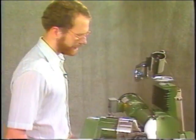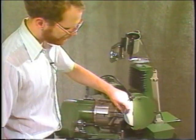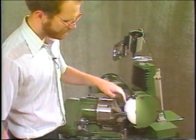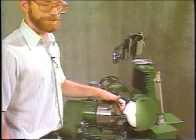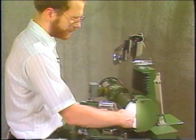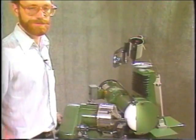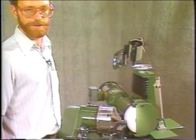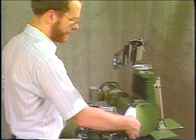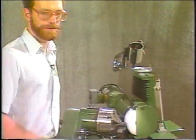Another way of maintaining lengths — especially if you're doing a lot of these — is to make a small gauge that you can slip onto the tip of the step drill. The gauge has a chamfer to sit down on the step, and the top of the gauge marks the point where the tip needs to be ground back to. You can even have a small notch for minimum/maximum tolerance on the pilot. With this gauge you can grind some off and check it right on the machine without removing the drill, then come back and grind more off one or the other as needed.